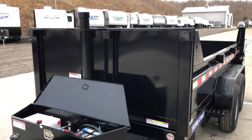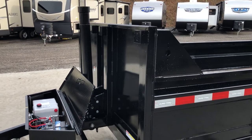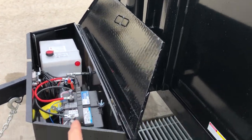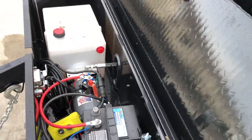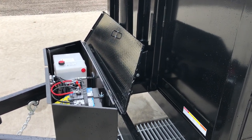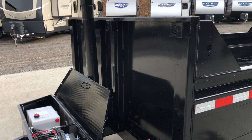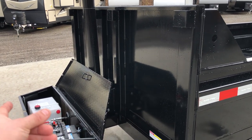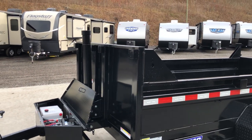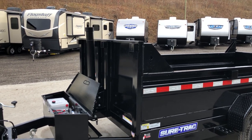One benefit to the telescopic, besides being a ton more efficient, is you can theoretically never lose fluid out of this system. All the fluid — if your battery's dead — only takes a tiny bit of juice to open your coil and let gravity take care of the rest. On a power unit, if your battery's dead, it opens the coil but you're draining one side, which will overflow the reservoir into the box. The much bigger benefit to the telescopic is that it is pointed vertical at the very front, trying to go vertical, which makes it a lot more efficient.